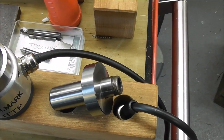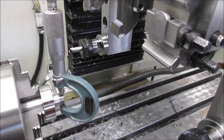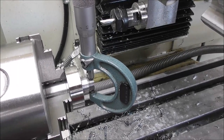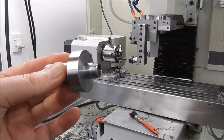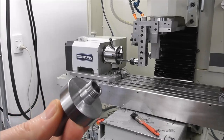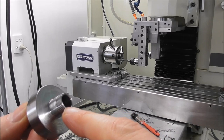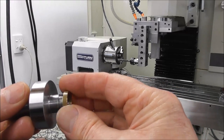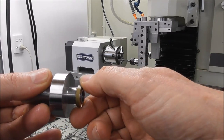The arbor has a 14mm thread and I have to get that fairly close. It's just a hair over 14mm — a good fit on the nut, but I probably should aim for about another hundredth smaller. We have the internal 30-degree centre for the cylindrical grinding, and we have the thread on the end for the pretension nut to allow the concentricity adjustment.